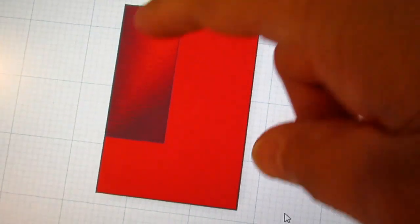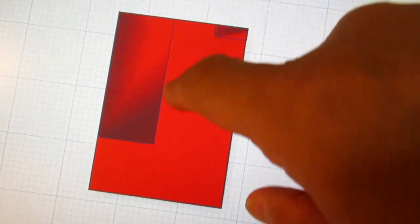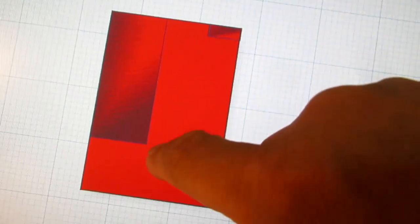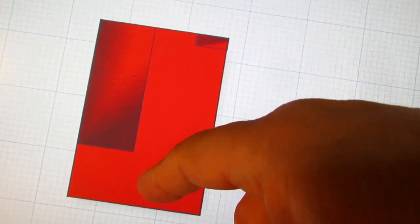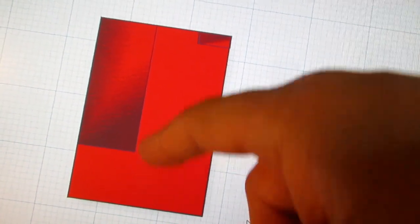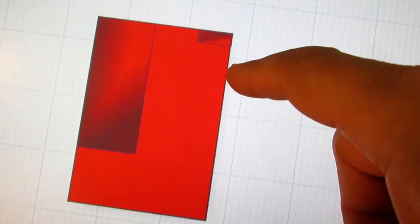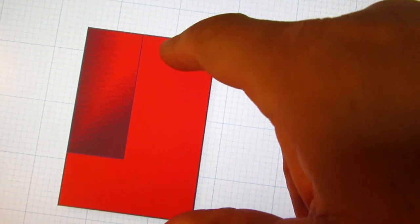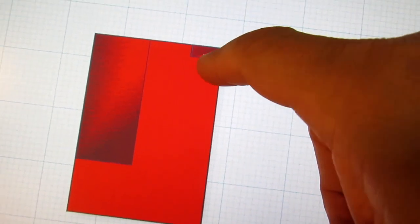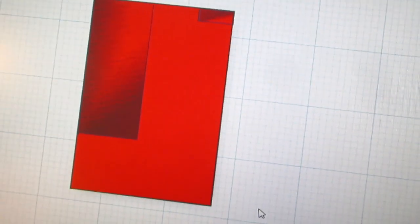Yeah, so this is going to be the cutout for the battery connector to fit through the rear of the box. This is going to be the rib that goes up against the rear. At least on the bottom, it's going to contact the rear of the aux power connector. The rest of it just doesn't need to be here. It's just that it makes it simpler to build. And this will be the cutout because this will be up against the top of the extrusion, which curves over a little bit. So I could just round it, but it's a more complicated curve. I'm not sure exactly what the curve is. Be a pain in the butt to measure it, so I'm just chunking it out. Keep things simple.